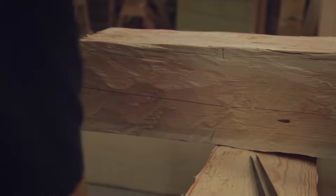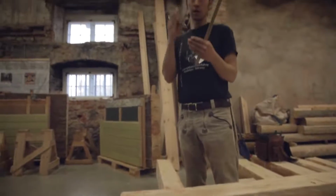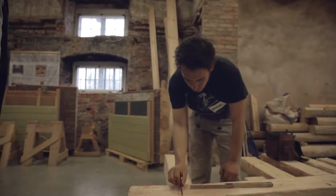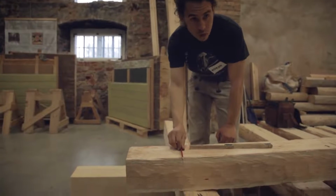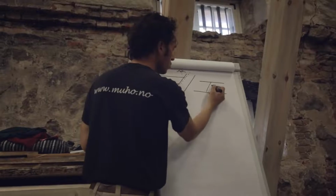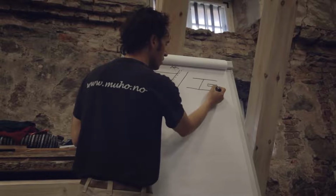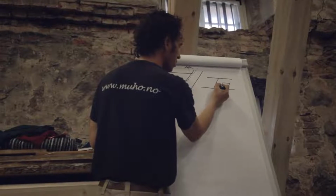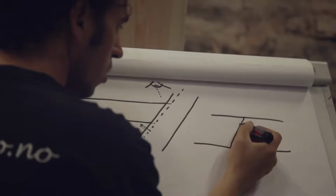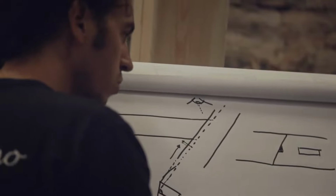Once you have done this, you do the same on the opposite side. Sometimes the cut is not perfectly flat. Most of the time it is, but you aim to have this angle, because this one you don't know. So you make the same on this side and mark here. When you do the mortises, often you do square here and here, and so it means that you will have like a hole, or you make the tenon steep too, and it doesn't work well.